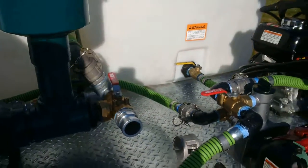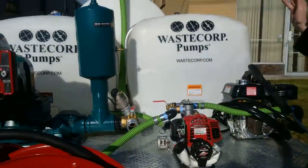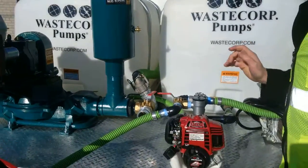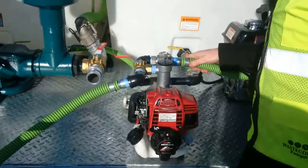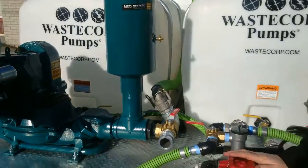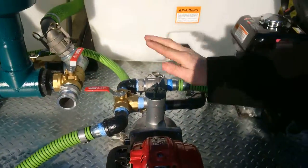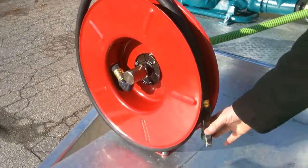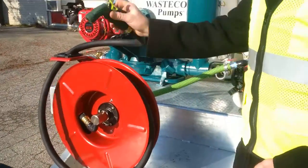Okay, so let's move on to the water tank and the chemical tank. You're going to turn on this small trash-flow centrifugal pump from the fresh water tank. You start the engine, the liquid comes in through this line into the pump, and then discharges to this hose reel, where you can spray and do any sanitation that you need.